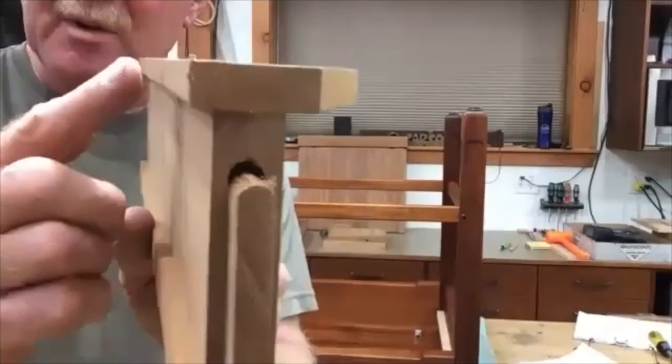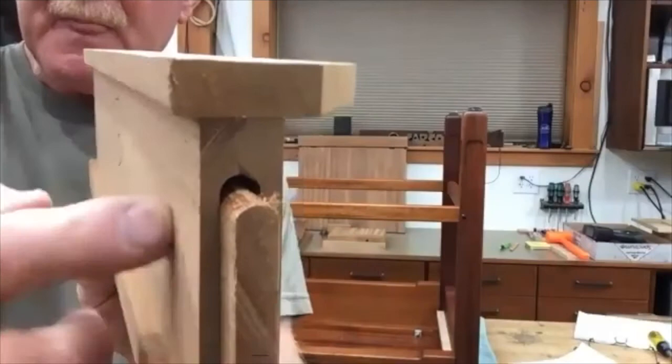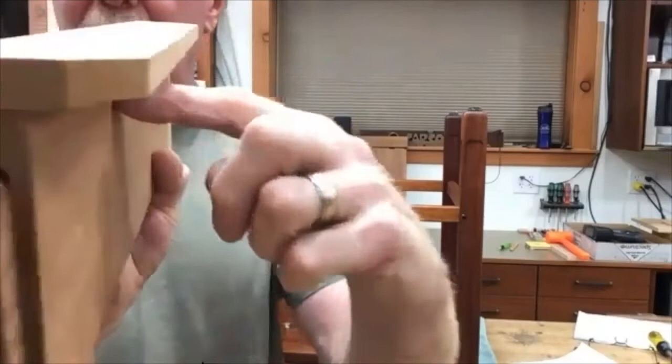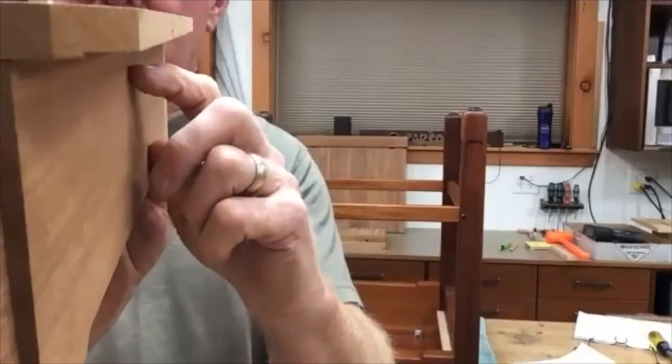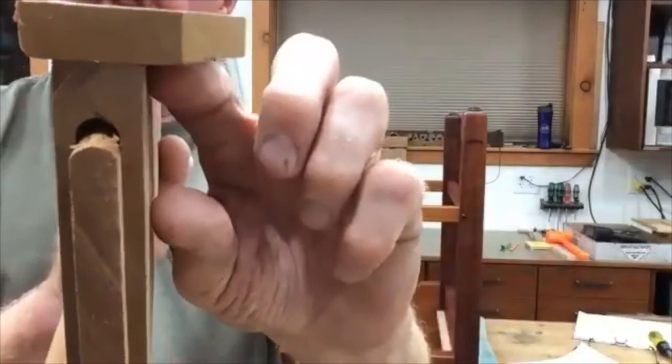And that gives us a step. This is where a lot of people in the class have said, well, why don't you do the same thing up there as you did down here? Just glue a piece on up there. Make the apron 1/2 inch taller and glue a trim piece on. And you could do that. And you could then still use Z clips into a little slot here to attach the top to the base. But you'd lose this flat reference surface that I'm using to put my little spacer strip in here to give me a spot-on location very easily to put that drawer runner.